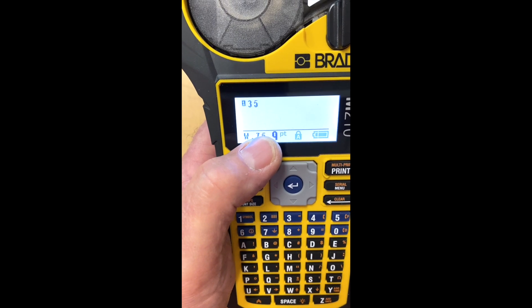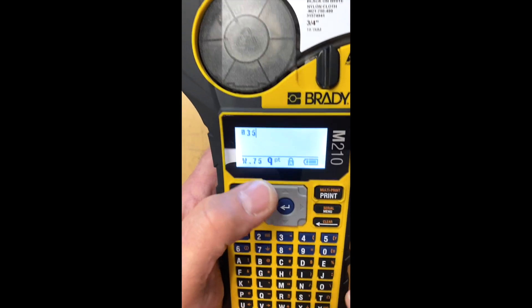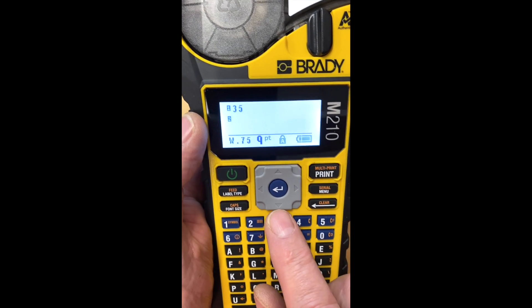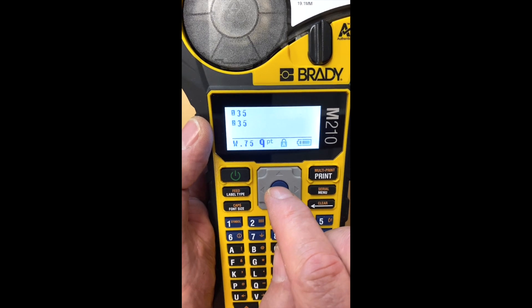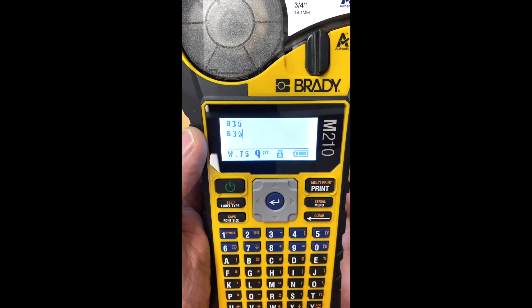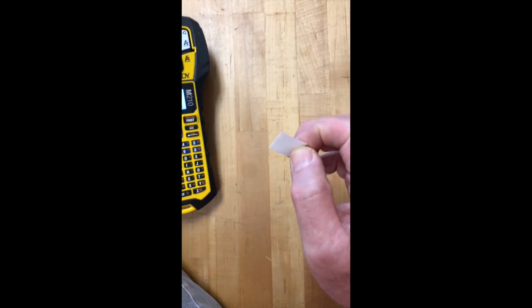A wire marker looks like a three-quarter inch label we're set up for — that's correct — and a nine point type font. Now here's where it's a little different because we've got line one, which has our wire number on it, and that's great. I'm going to hit enter, and look, it just added a line two. So I'm really going to print two of the same data on the label, so I'm going to type in 35 there also. It will tell you if you try and put too much data — if I try and hit enter and add a third line, it says it cannot fit, because it knows the size of label I've told it I'm using and the type font size. It's just saying a third line isn't going to fit. I'm good with that. I'm going to hit print.